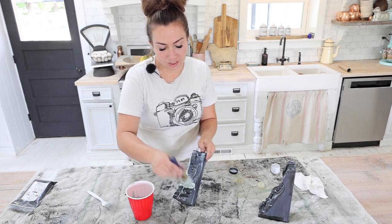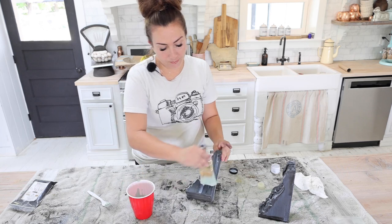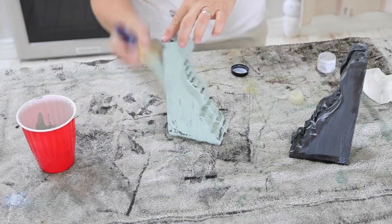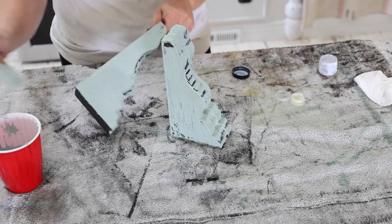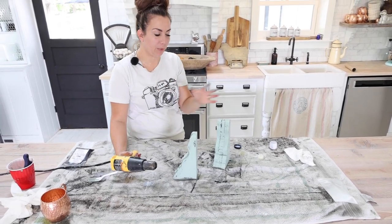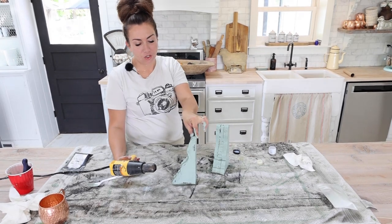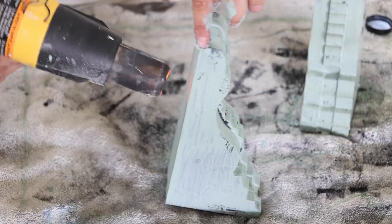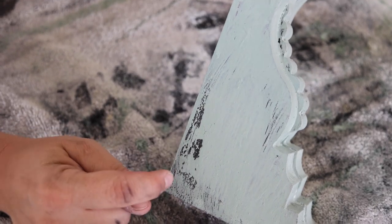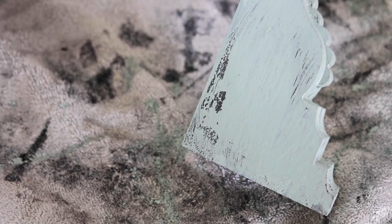If you have white it might take two coats — just depends on the coverage you want. Again, I'm not worried about perfection because I want it to be chippy and yummy. You don't want full coverage; remember we're going for chippy. The full black coat is really what's going to shine here. Now that I've got one coat on, I'm going to heat gun it — if you don't have a heat gun, just use a blow dryer. This really is going to help make it chippy. See right here where it separates a little? This is where I used the wax and that helped create a resist.